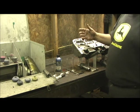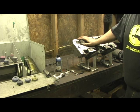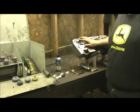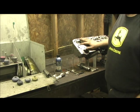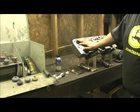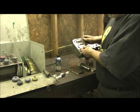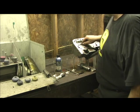When we say concentricity, what we're talking about — I like to see my valve jobs get under one thousandths run-out. I've even gotten a half thousandths run-out on some of my race jobs, while those machines can probably get one and a half thousandths run-out typically — average is two, one and a half — but they can do it real fast. It takes me approximately four hours to do a valve job on a set of my heads: put all the seats in the same position, the same width on the valve, the same spot, and get the seat run-out exactly zero.